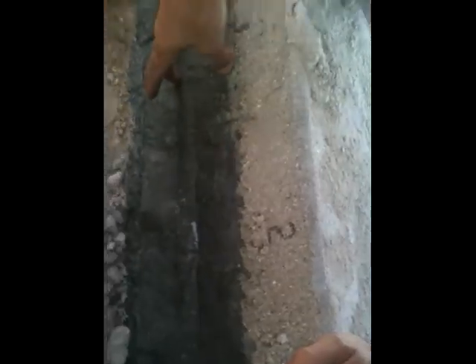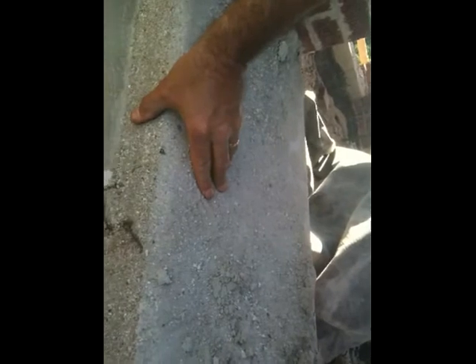We also repaired the core and then rebuilt the rest. This is poured concrete, and behind this black tar is limestone. If you look from the outside you can see there's a joint — a head joint in the original limestone. My guess is that this concrete was poured as an attempt to seal that joint.